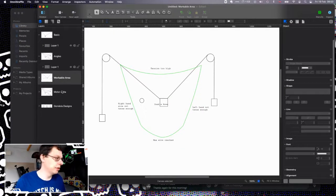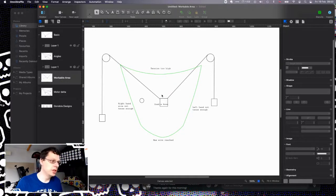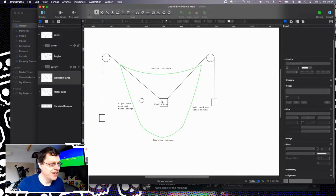You're not going to get very accurate plots with these, by the way. If you want accurate plots, build an XY plotter — it's that simple. The rigidness of the structure matters more with an XY plotter and you can do end-stops for self-homing. With this V-plotter I don't have self-homing, which causes me problems, and there are some other issues around V-plotters as well.